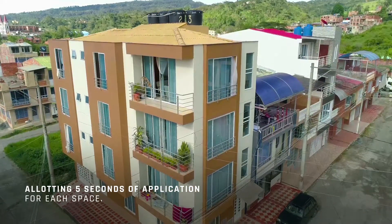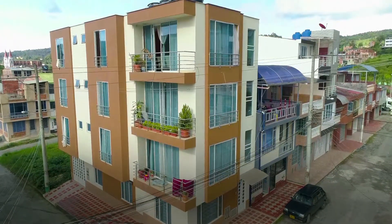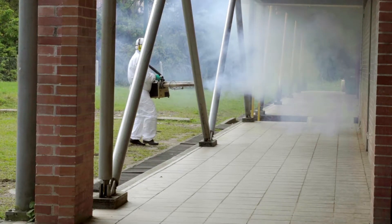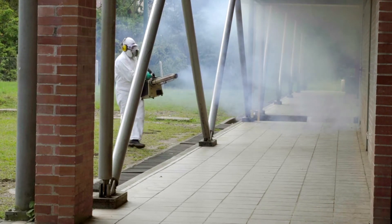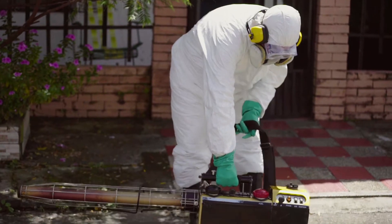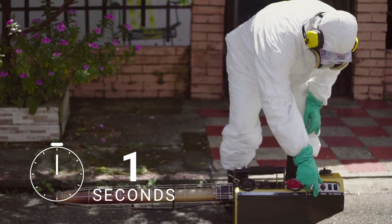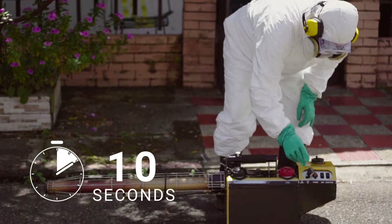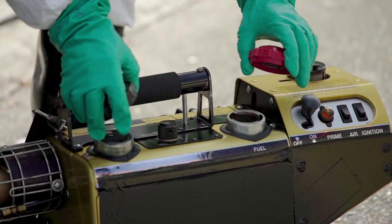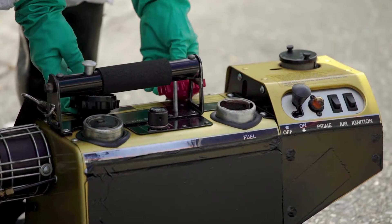In small spaces, the spraying can be done from the entrance or from a window without having to enter the dwelling entirely. In buildings with several stories, space fogging begins on the upper story, moving downward toward the ground floor and from the rear part of the building toward the entry, walking backwards and moving away from the fog in order to minimize exposure to the insecticide and to ensure visibility for the operator. To turn the machine off once the fogging is finished, the mixture's shut-off valve should be closed to prevent more insecticide from being released. You should wait 5 to 10 seconds before shutting off the motor. Lastly, you should slowly open the covers of the two tanks to release all the pressure in the tanks and prevent any potential combustion of the gases.